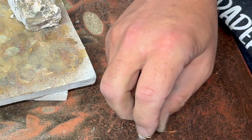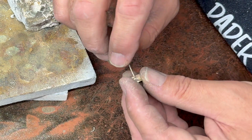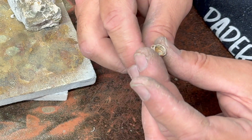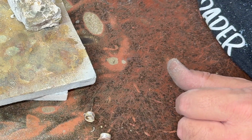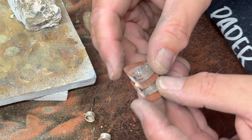Alright, and those have become really annealed and soft, so what we'll do is we'll bend them over and twist them after everything's polished, and just twist them until they work hard in themselves again. But let's drill those holes in these things. You probably don't need to watch me drill the holes since I just drilled holes for you. But I'll be right back after I do that.